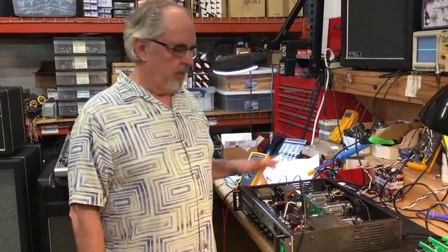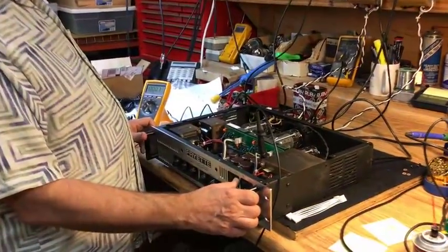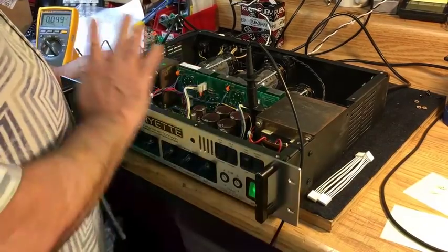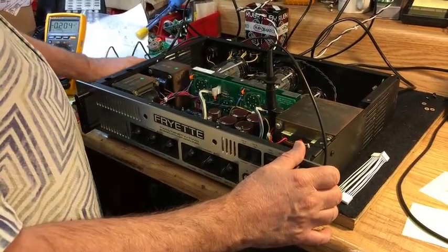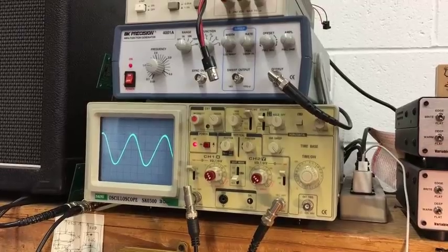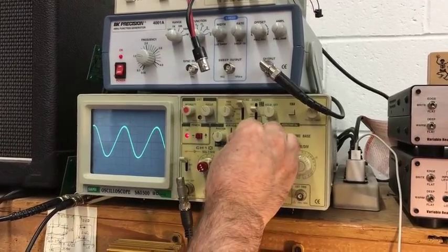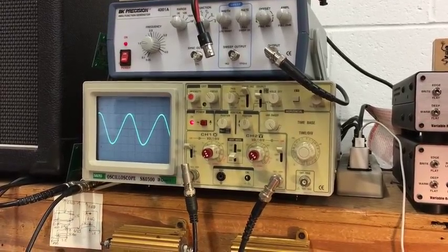We're back — it's the moment of truth. Now we're going to turn the standby switches on on each channel. The power supply has already been operating, so turning on the standby switches doesn't do anything except connect the tubes. So far we're good. Now we're going to bring the signal up and we'll see it on the scope. I'm just going to gradually bring it up — I'm feeding it a sine wave signal. And here we go. That's both channels running simultaneously — I move the right channel up and down with respect to the left and you can see they're right on top of each other, meaning they're both doing exactly the same thing.